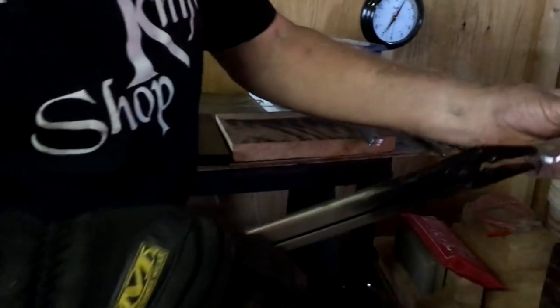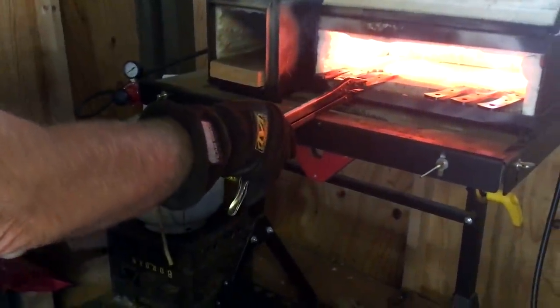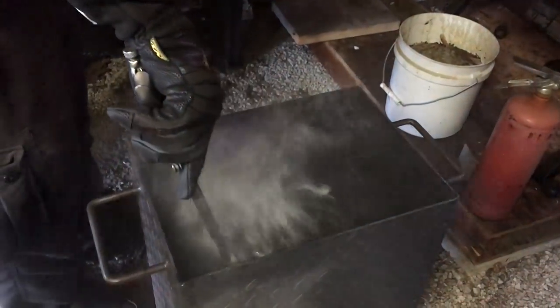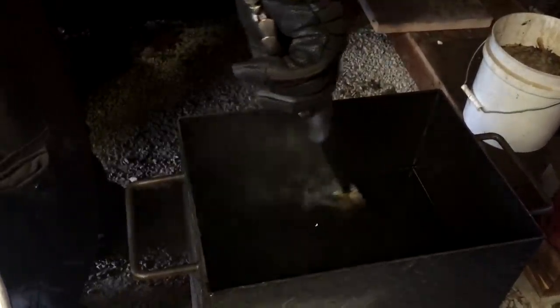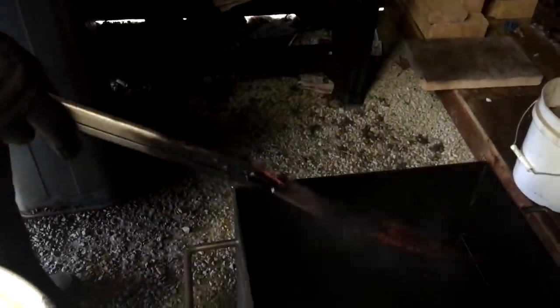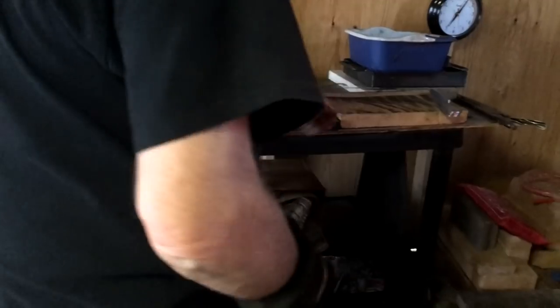Take the next one. It's going in — put it in place where I had the last one. Take the next one out and get it ready, all the way up into the oil. Get deep enough to kill the flame. You can see a little bit of oil around it. The oil is going to stop now. We're going to wait about 15 seconds again. Just keep moving it around in the oil very gently. Time to remove it. Time is not super critical except you need to go at least 15 seconds. We're going to wipe the excess oil, clean it off, then get a fresh knife and put it in.